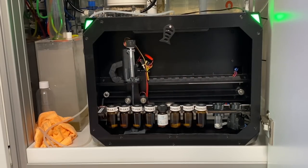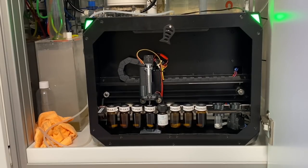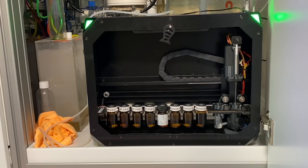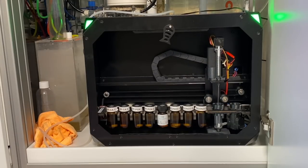Once it's sufficiently cleaned the syringe, we go across, spin reagent two, put the syringe down into it — you can see the syringe bending quite drastically on the way down, not quite aligned, but that's all right. It slowly draws out the required amount of reagent two, waits for that volume to go into the syringe, then goes across and puts it into the black chamber. Then it spins the solution, waits the required time, checks the color against the API phosphate color chart, and reports back to my phone what the value is. Finally it cleans the syringe and gets itself prepared for the next test.